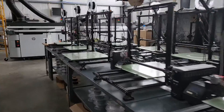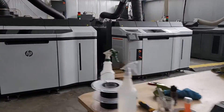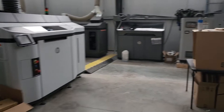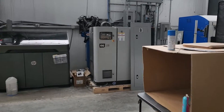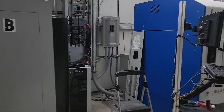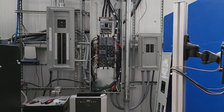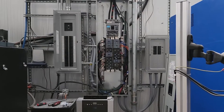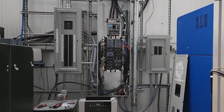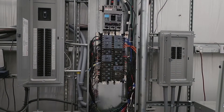Flipping back around to show you a little about the power coming into the building — it's three-phase 480 volts, coming into the back side of our building. It's 400 amps total coming to the entire complex, and then it splits into 200 amp services. We actually have two meters, and this is just one side of that. It's definitely a lot more power than you're typically used to seeing in any household environment.